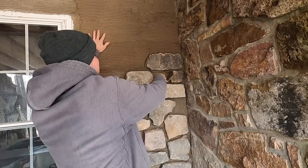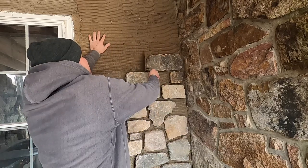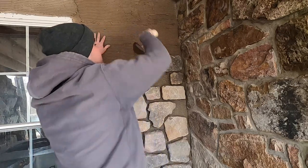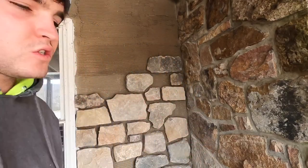Okay, so that's where I want it. I like to seal my joints — I go along the top with the mortar that got pushed out. And that's it — that's how you lay a stone. It's kind of just like a puzzle piece: you step back, look at it, figure out what's going next, and go from there.